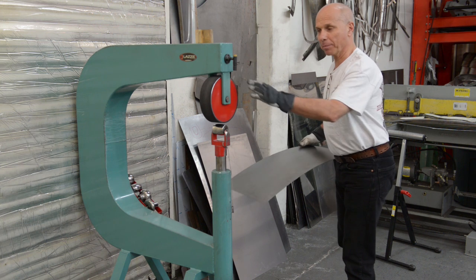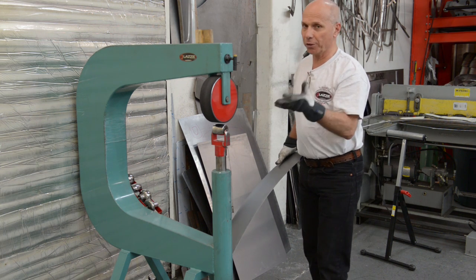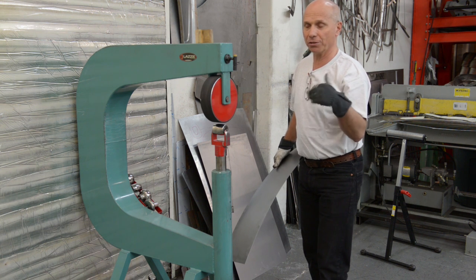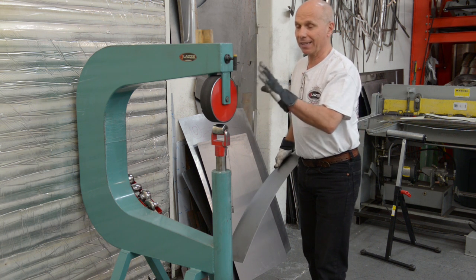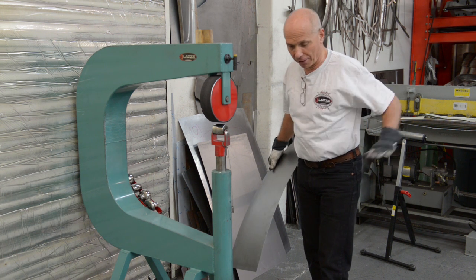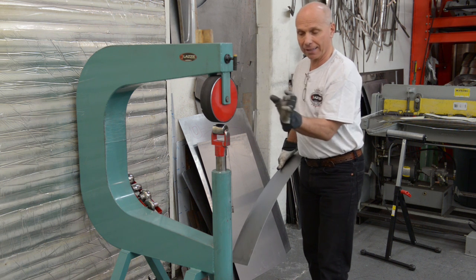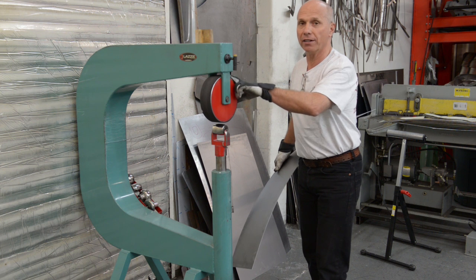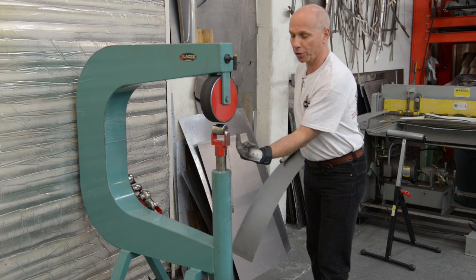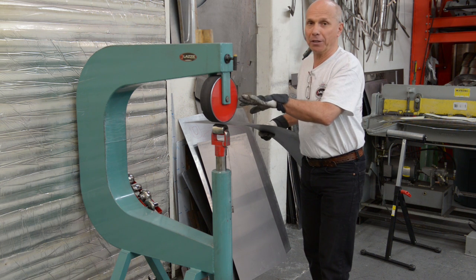I'm back at the English wheel and I've put the rubber band on the top wheel. For those who haven't seen what the rubber band can do, we have several videos on YouTube about that. It's an inner tube from a truck tire — I cut it flat on the table and slice it to get this width, then put it over the top wheel. What it does is the lower wheel pushes up the sheet into the soft rubber and it only bends it in two dimensions.